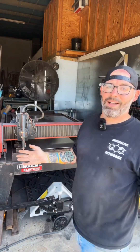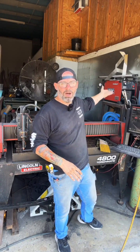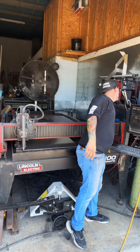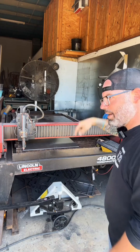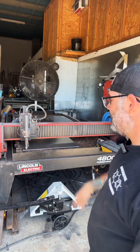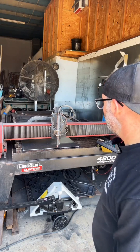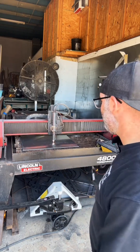I just set program zero and we're ready to fire it up. I can safely turn my plasma cutting machine on now since I'm not going to be sticking my hand under here anymore. I'm going to turn it on and let it run through error cycles. Let's put it in dry run mode and run the square to make sure it's going to run exactly where we need — it's not going to fire up. It comes down, touches the material to confirm the material is there, and now it's doing the exact path of what it's going to do when I decide to actually make the cut. This is called dry run mode.